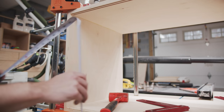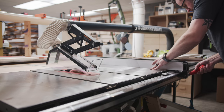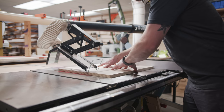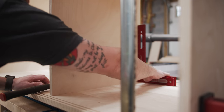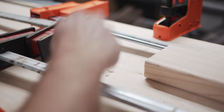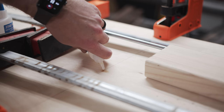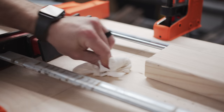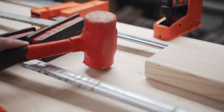While the glue dried, I cut the center divider to size based on the actual dimensions of the finished cabinet. I was able to get the cabinet top, bottom, sides, and the center divider all out of that one 5x5 sheet of plywood with almost no waste. I decided to attach the center divider with brass pins on the top edge and screws on the bottom edge. After marking out the location of the divider and verifying it was square, I drilled some eighth inch holes and added some eighth inch brass rod using CA glue. I'd recommend using painter's tape to catch excess glue, as the CA glue really soaked into the veneer and required a dangerous amount of sanding to remove it.